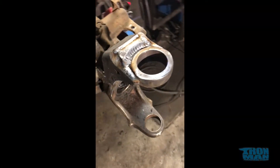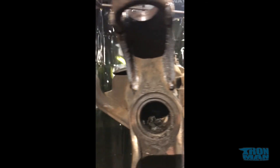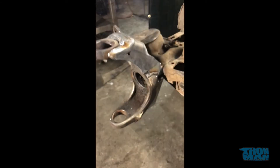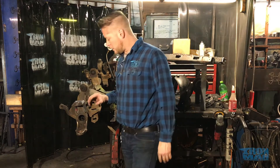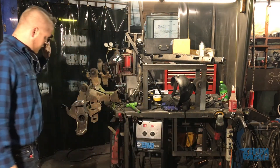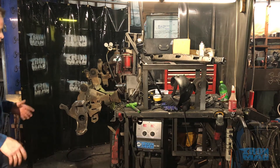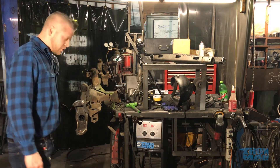This whole side is good the whole way — and that's a wrap. This entire side is done. Let it cool overnight. Don't quench it with water — just let this entire thing naturally cool. You're not going to get enough heat over here to hurt any actual seals or anything. Remember: clean your metal where you're going to weld. Don't try to weld through all that garbage — it'll just spit back, make a mess, and you won't get any true welding. You'll just get really frustrated.